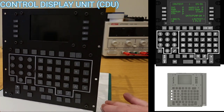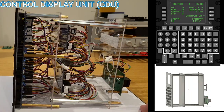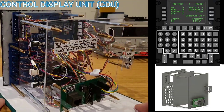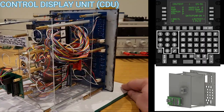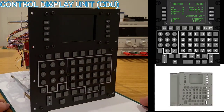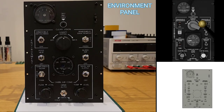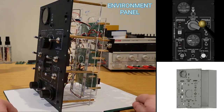For the CDU, this is really comprised of two key parts: the keypad and the display. At the rear I often write notes to myself so if I revisit something in future it's very clear how it's set up. In this case the display is run via one Arduino Mega, and the whole keypad runs into a separate Arduino Mega over the RS485 network. One of the key benefits of using this type of network is it's only one COM port on your computer per network, and that network could support a whole heap of panels.